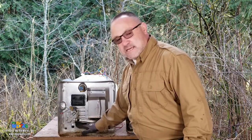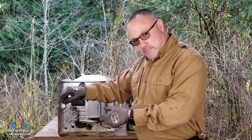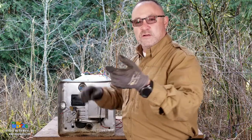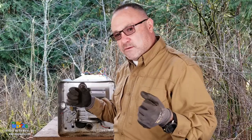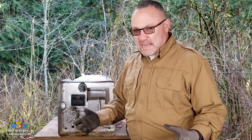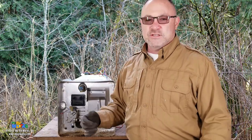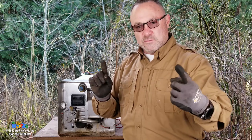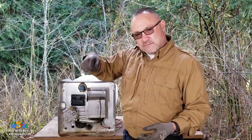So all that's going to settle down here at the bottom. And so if you don't actively backflush, go run to the service trailer and get that yellow backflush one. It's in drawer two, and also the copper one that we made. So Dakota's going to run and get the wand that we use to backflush these things. Backflushing is a very active process, where draining is a passive process where you're just going to let that water drain right on out. Backflushing is an active process. You're going to need a garden hose and a wand, and you're going to get in there, and you're going to really go to town trying to spray all that stuff out.